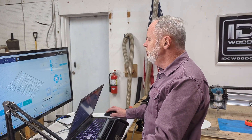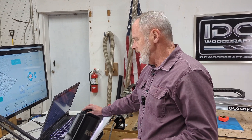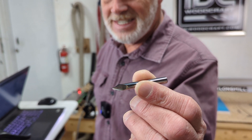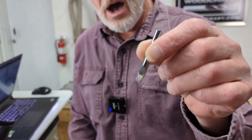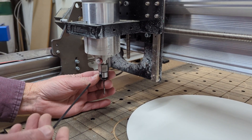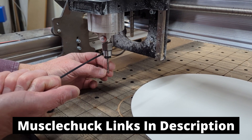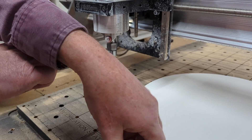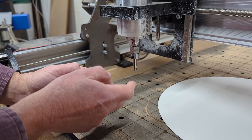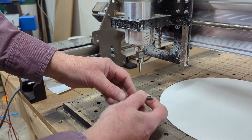The first thing we have to do is move the machine to exactly the point we want it. I'm going to bring it relatively close to those cross lines. We're going to take a V-bit — the IDC Woodcraft Ultra Smooth Cutting 60-degree V-bit — and use the point as a reference on these grid lines. You'll notice I have something unusual for the Makita trim router called the Muscle Chuck. It's a super fast way to change out your CNC router bits. I'll put a link down below. I'm going to swap the current bit out and put this V-bit in — and that's all done. If you've got a Makita router, you may want to get this Muscle Chuck, along with the 1/8th collet adapter. Both are available on IDC Woodcraft.